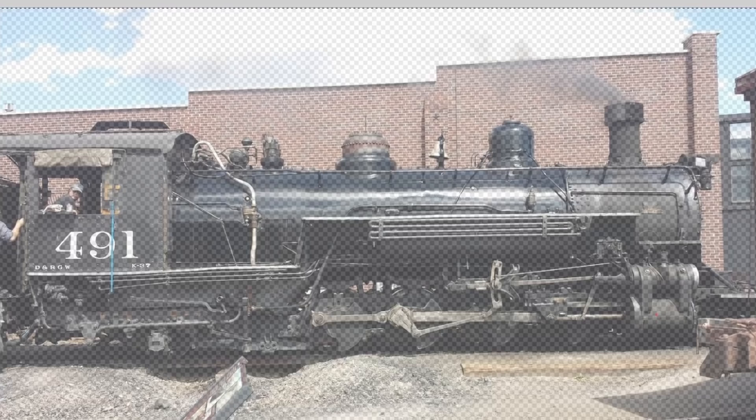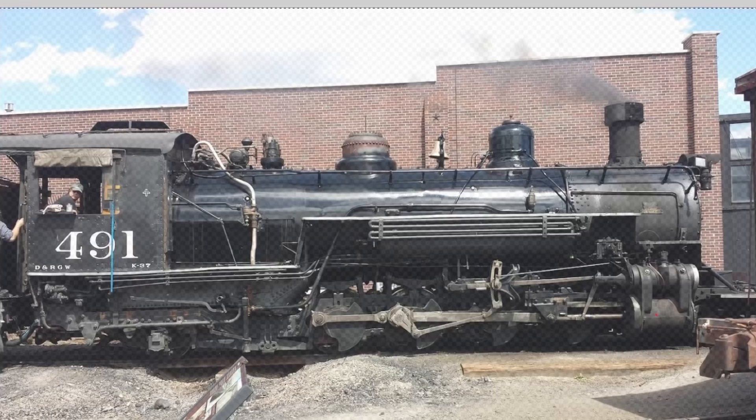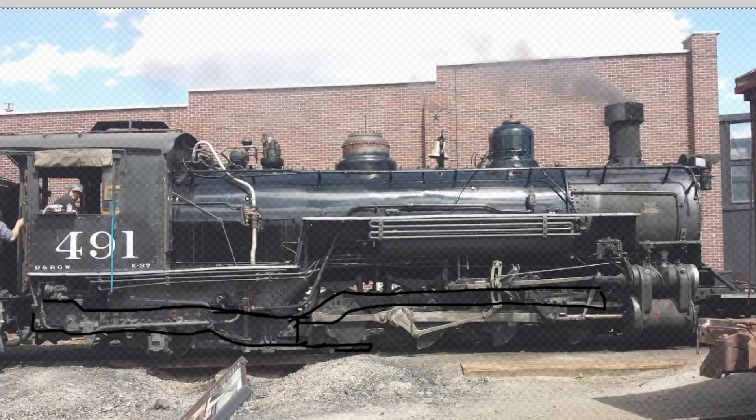Level six: the frame and running gear. You have frame rails that run all the way down the locomotive. There's the rear frame extension where the trailing truck lives, the frame splits into a main rail up top and a second rail on the bottom with binder straps that you can remove to take axles out, then they recombine up front to distribute pulling forces all the way through. The drive wheel has an axle in the center with a bearing on top called a crown brass — made out of brass — that distributes the weight of the locomotive onto the axle and allows smooth rotation.